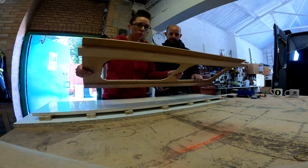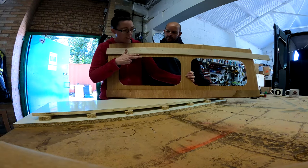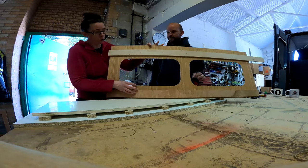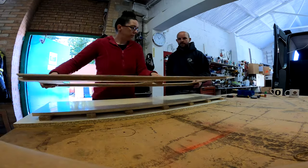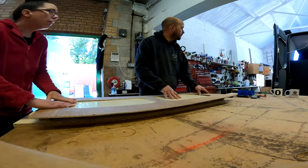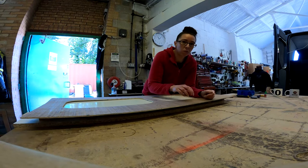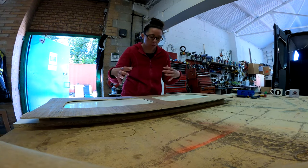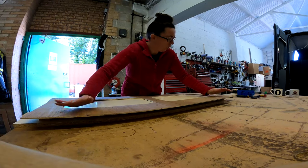This is our jig that we use to make our holes — our router follows this. We've got different size offsets from the top to the bottom, and it's a little bit bigger at the bottom to allow for the aluminium angle we use at the corners, so we have an extra 10mm at the bottom. By appearance, the door looks like it's in the middle. We level this up, and because of the two pieces of wood on the back of this it stops the door panel from sliding and keeps it locked in one position, so when you're routing it's not jumping all over the place. We line it all up and then clamp it.